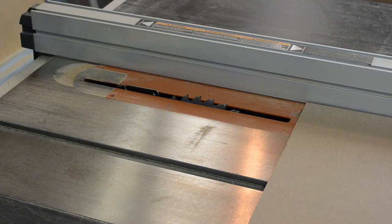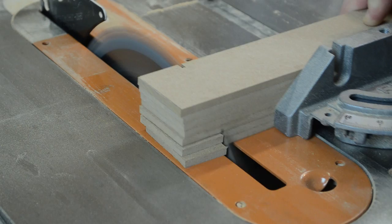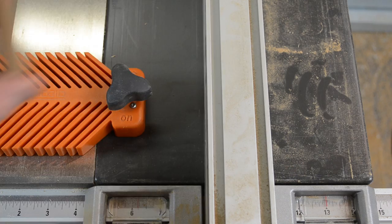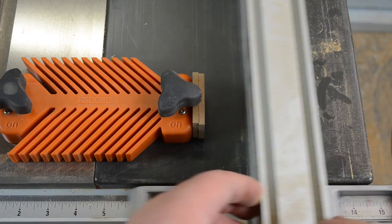I then cut approximately 40 pieces of hardboard, which would make up my slat wall. The spacers on my slat wall were going to consist of three-quarter-inch thick plywood, cut to a width of approximately three-eighths of an inch. To cut repetitive narrow strips, I like to take a spacer block that's the size I want to cut plus the thickness of the blade, then install a magnetic feather board next to the fence with that spacer in it.